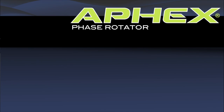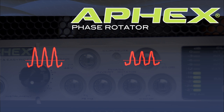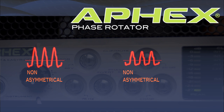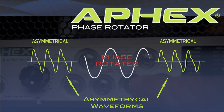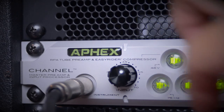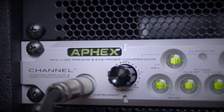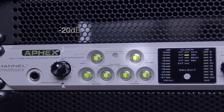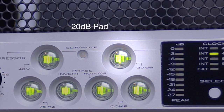The job of the phase rotator is to produce symmetrical waveforms. If you've ever looked at a wave file in a digital audio workstation, you'll notice that sometimes the energy is higher on the top of the wave than it is on the bottom, or vice versa. The phase rotator solves that problem. Not only does the symmetrical waveform sound better, but it makes the job easier for the processors. Sometimes, even when the input gain knob is turned all the way down, the input signal can be so hot it's still clipping the input — this is when you engage the pad. It brings the signal down by about 20 decibels and brings that input signal under control.